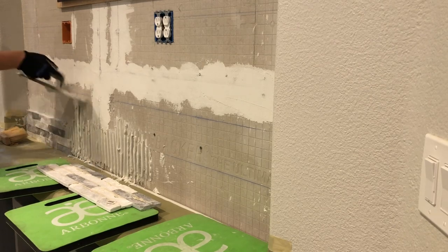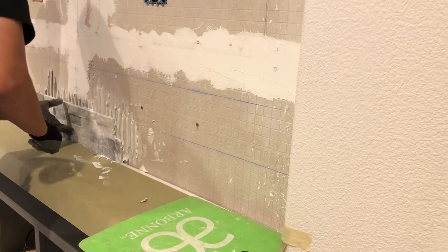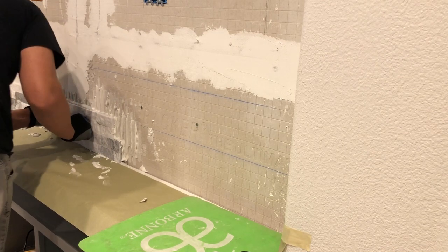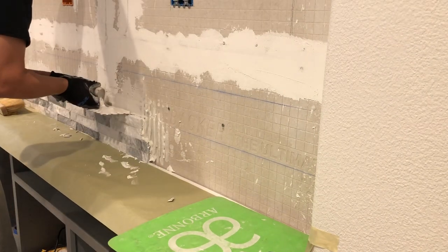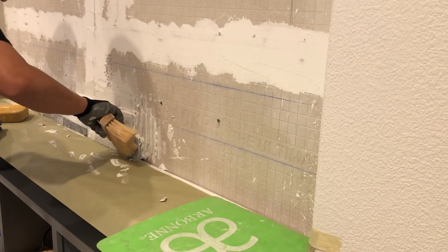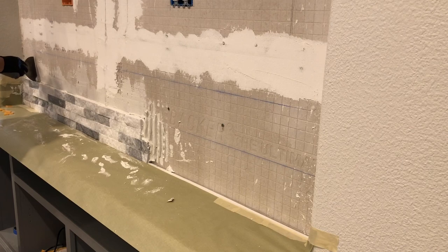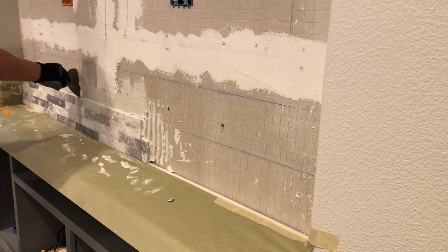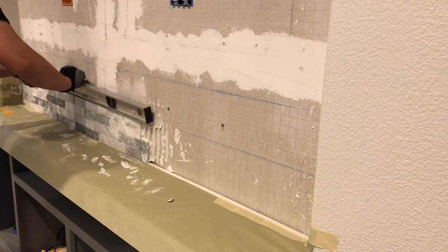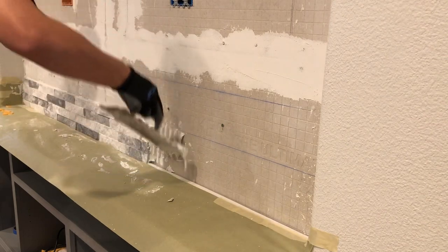We started by spreading the tile mortar with a trowel and laid the stone evenly. We cleaned up any mortar that might have got onto the stone, since it will be difficult to clean once dried. We also made sure it was leveled before we continued. Once everything looked good and we made sure the stone adhered to the cement backboard, we continued to work our way up.